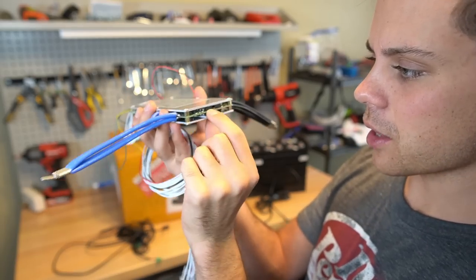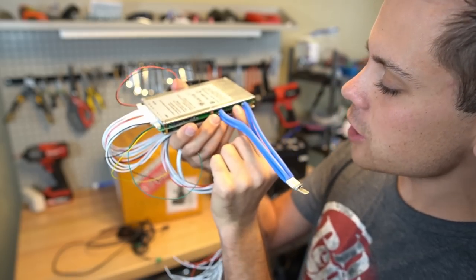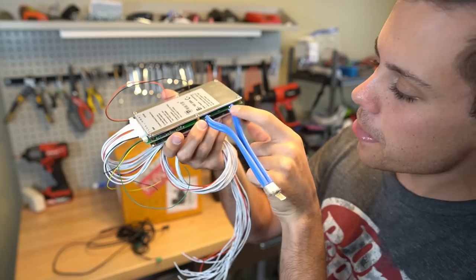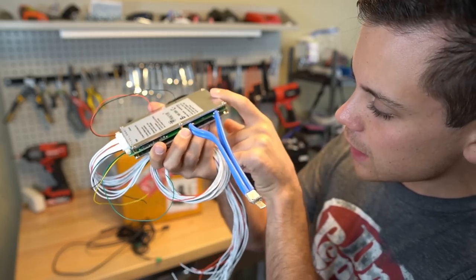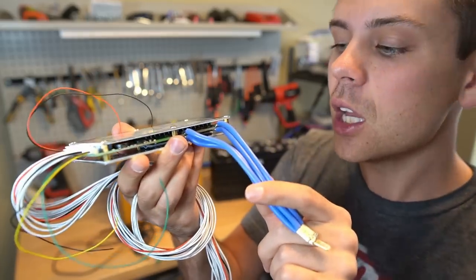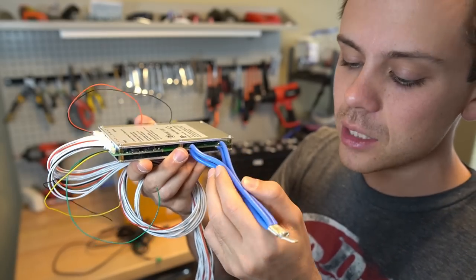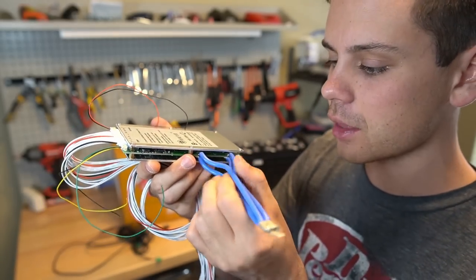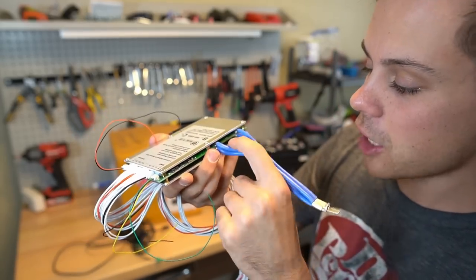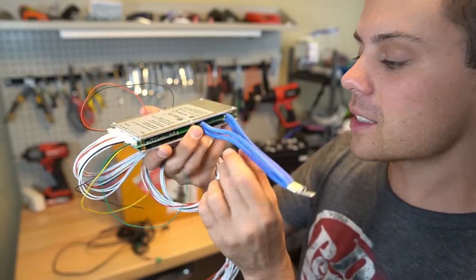Looking at the MOSFET side, there's not much room between the heat sink and where you have to solder, so when you add more wires you don't have much room to work with. These appear to be 12 gauge with very thick insulation that looks like 10 gauge. So I guess you'd have to add a bunch of 12 gauge wires to achieve the rated 320 amps — which is kind of silly.